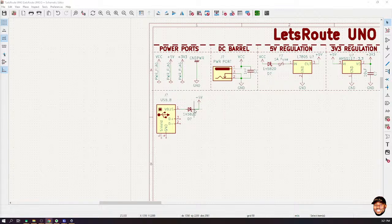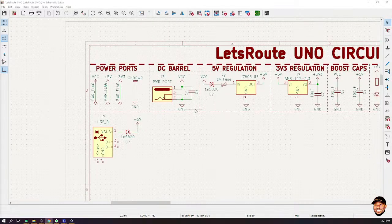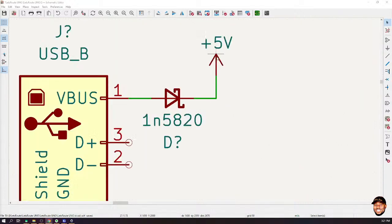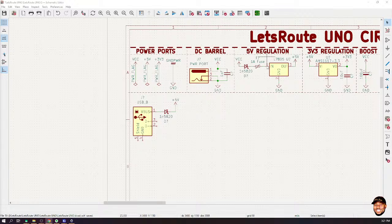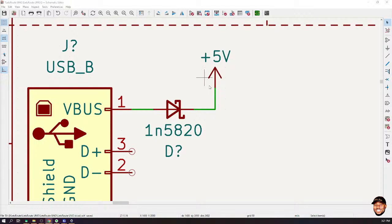I remember the first scenario that I said, let's say I connected an external VCC and then something happened. This voltage breaks down, and instead of 5 volts, it is producing 6 volts. You see, that means that this point will go, because this 5 volt is attached to the output of the 7805. If it generates 6 volts, then it is going to put 6 volts over here. And what will happen if I have 6 volts here and 5 volts here? What will happen?